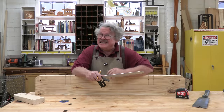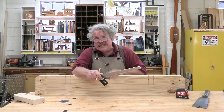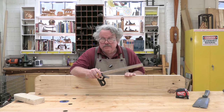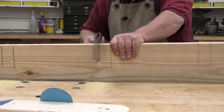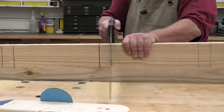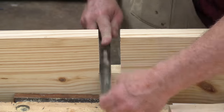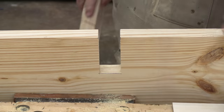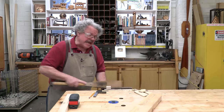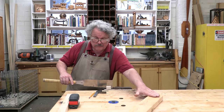There's just one more thing to do before we can assemble this. We need to cut the slots in the rails that will hold the stretchers. Experience tells me that these slots should be about one eighth of an inch — that's three millimeters — wider than the stretchers they will hold. Using a hand saw, cut the sides of the slots, stopping when each cut is three and a half inches or 89 millimeters long — that's as long as the stretchers are wide. Use a sharp chisel to knock out most of the waste from each slot and then flatten the bottom with a rasp. Test fit the stretcher in each slot. The slot must hold its stretcher flush to the top of the rail. And while you're set up for hand sawing, find some scraps of plywood and two-by material that you need for the spacer and the lips of the loading arm and then cut them.